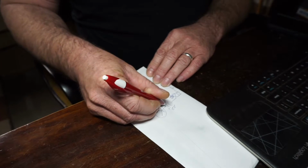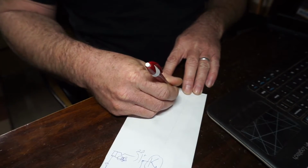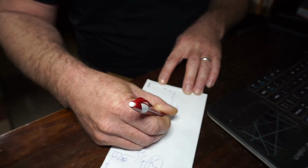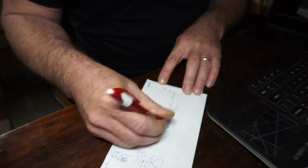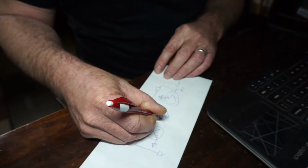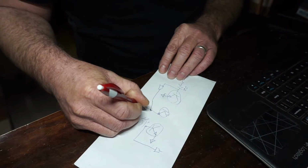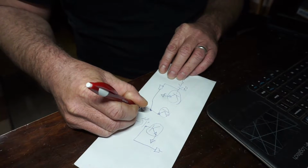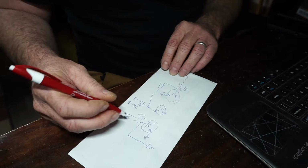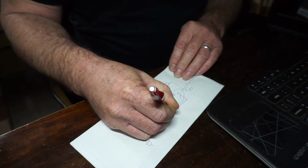Ground. Bring our emitter follower over. Okay. I should have done this way. Point two, you do NPN sign ground, circle that emitter follower over to our, I mean, I can basically draw this in my sleep nowadays anyway. NPN sign down, we're gonna tie into that emitter, drop this down to our fuzz pot. And then our wiper goes to our cap. Go ahead and mark your pluses just in case you're dumb like me and you get lost easy. Let's go ahead and connect our collector to our base.